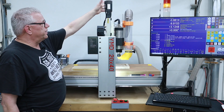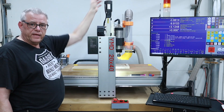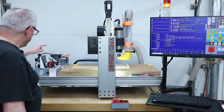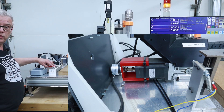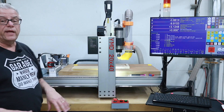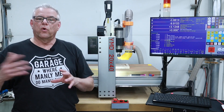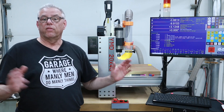The important thing to remember is there are two important aspects to a closed loop stepper system: the encoder that feeds back to a matching stepper drive that is also suitable for closed loop operation. Over here I have another stepper motor — you may have seen this one featured in my videos about the automatic tool change system. On this stepper motor I added an encoder, but that's still running truly fully open loop. That encoder feedback is being read by another microcontroller just to count position — it has nothing to do with feedback to the stepper drive to close the loop.